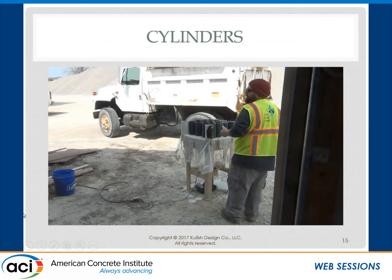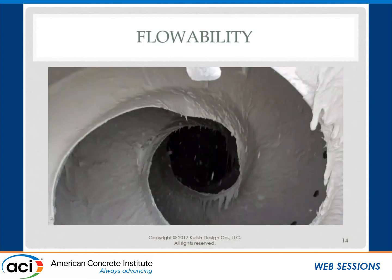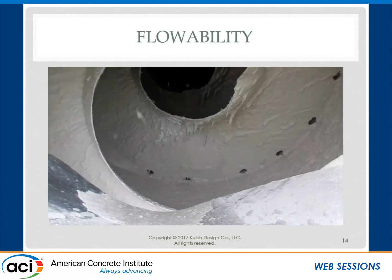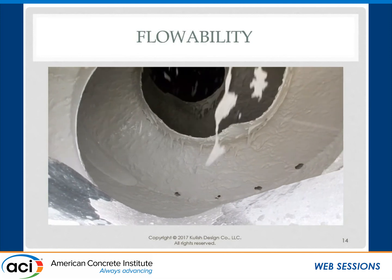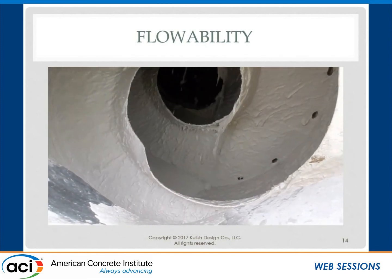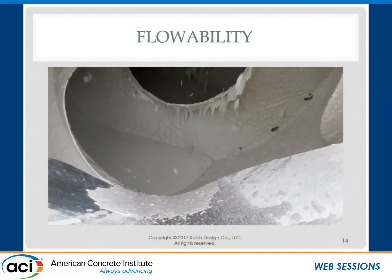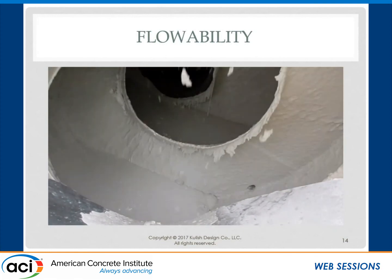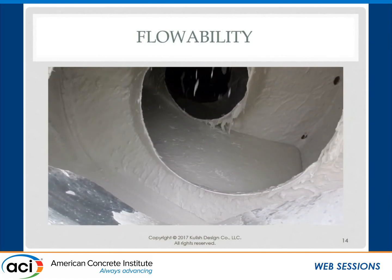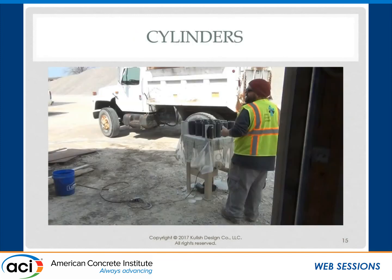This is probably my favorite video. The challenge here was fibers flying and stuff all over the place, but what you're not seeing is lumps — no balls of fiber, no bird's nesting. We're unscrewing the product very slowly: first to let the air out, and then to prime the chute. What we've done initially — and you can find this online — is we prime and get the chute out, which gets rid of any dry powder. Then we reverse the direction of the motor to completely eliminate any powder. By reversing the drum direction and then bringing it forward again, it eliminates that completely.